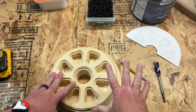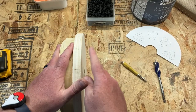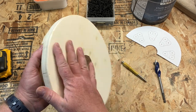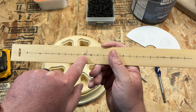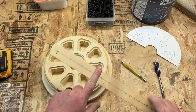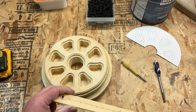Glue these together — if it was just glue holding this together I'd be nervous, but there's more going on to make the whole wheel work. For the back part, if you have access to scrap three-quarter inch ply it is the absolute best thing here — you only need an 11-inch circle, as the spoke section is four and a half inches and the outer is 11 inches. I use a little homemade jig with a nail to spin and get my radius, great for doing circles on plywood, and it gives you that center point so when you do your other drilling you've got a starting point that matches the radius.